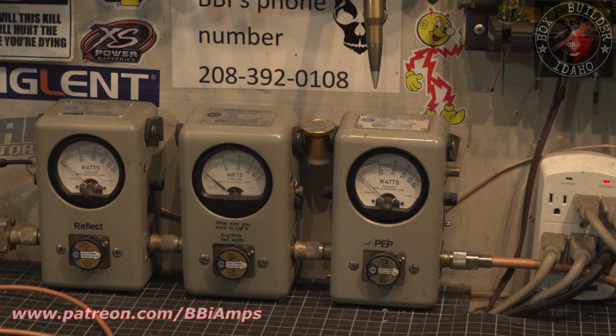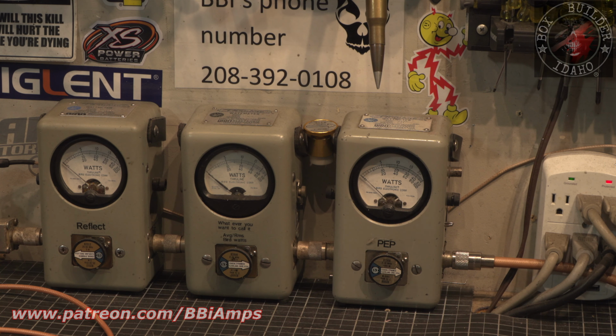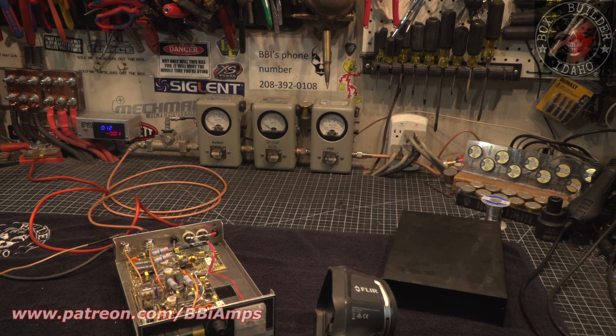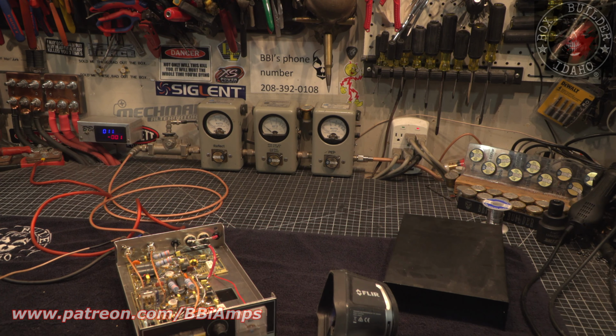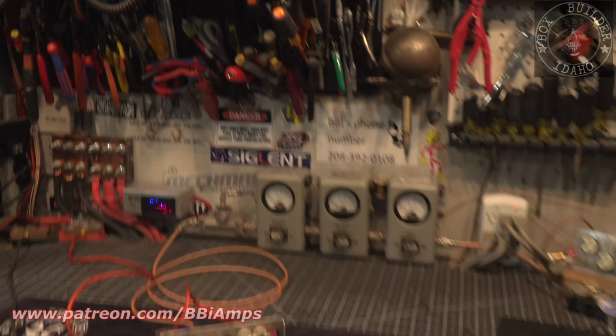Okay, so now we're going to put the derail striker, which is on 12 volts. We're going to put about 80 watts into it, which is a little bit hot. This thing isn't really designed to take more than about 65, but let's see if parts start coming apart. I doubt they will. Amp on, variable open. Hello, audio. Oh, 450 watts. Hello. An input SWR of 1.9.